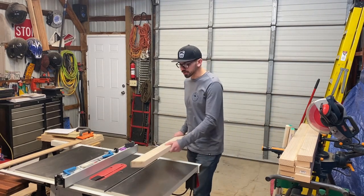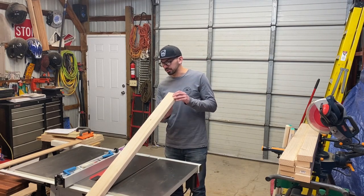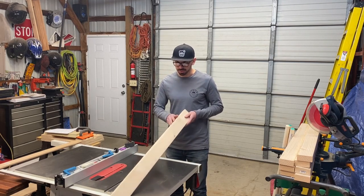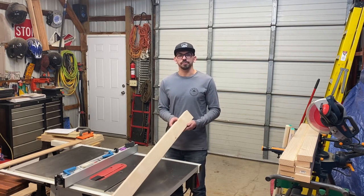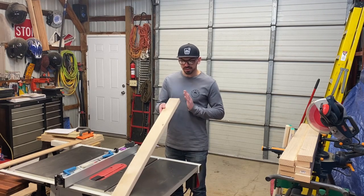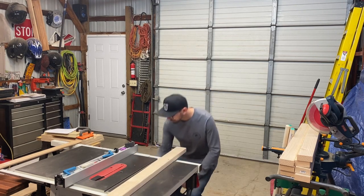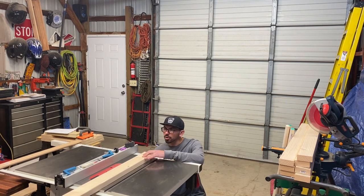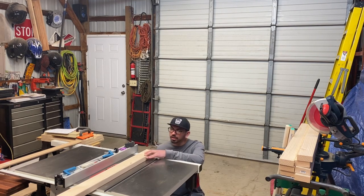The first operation I'm going to do here is take a clean cut on each side and eliminate any mill marks or leftover damage on these 2x4s. These are just standard 2x4s and they're going to work great for children's toys. They're going to get beat up relatively fast, but I'm just going to clean these up and then put a perfect rolled edge on them later. We'll raise the blade to just above the work piece and make several cuts to trim all of these edges up.